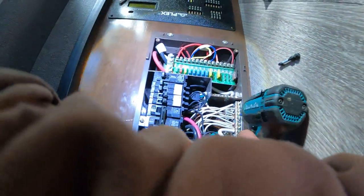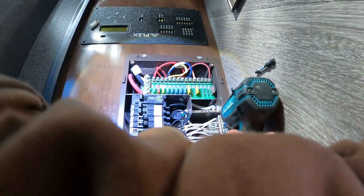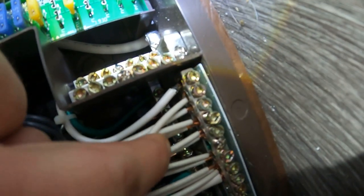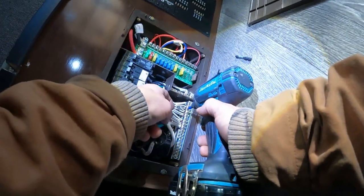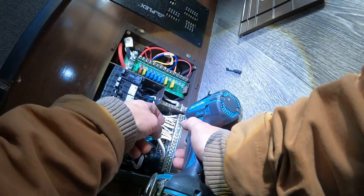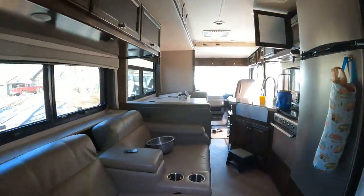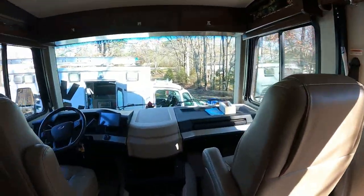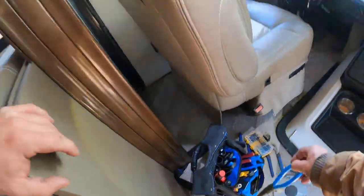There's her problem — right there. Neutral bar. Sliding right in and out. They didn't push them in from the factory enough. So we gotta fix the neutrals. Let me get some needle nose. They do take care of this RV, I'll tell you that. That was the problem with the microwave — never gonna work if the neutral wasn't on.